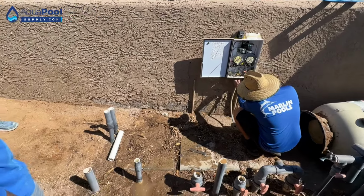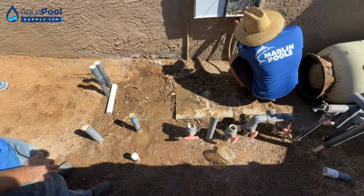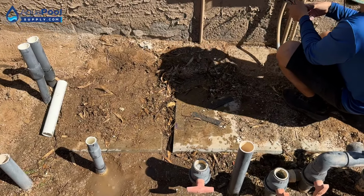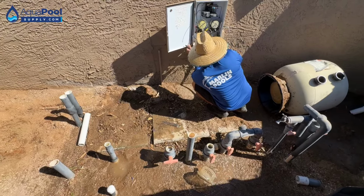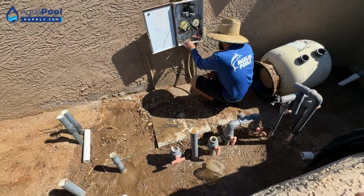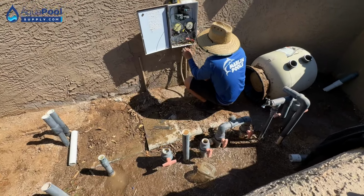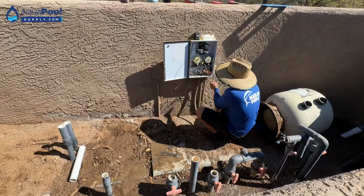So what I'm gonna do is probably take the 2x2 out. Yeah, if you can take out the concrete pads, you're going to use the poly pads or whatever they're called. Well, what I'm thinking is if I have enough earth that I can grade it right over top of the old cement pads so that it has more of a solid base to sit on, and then also bring the land up a little bit more so that it's in less of a low spot.